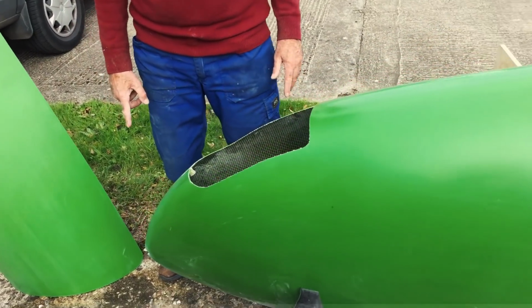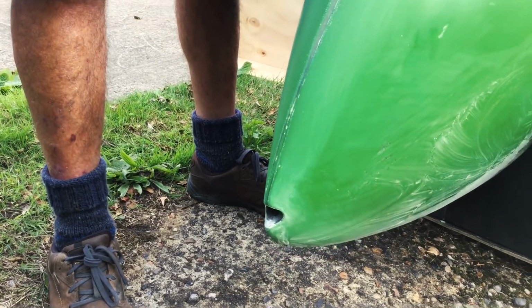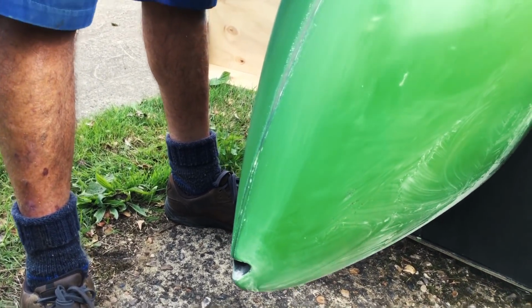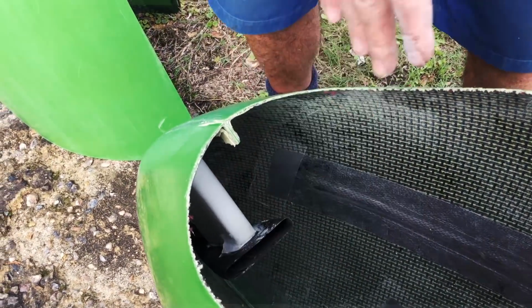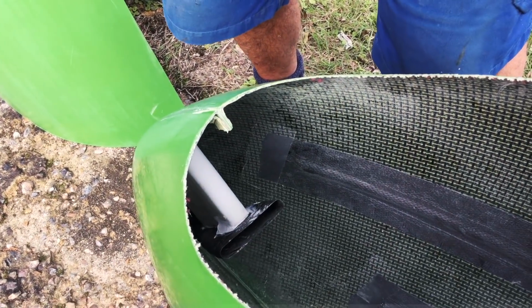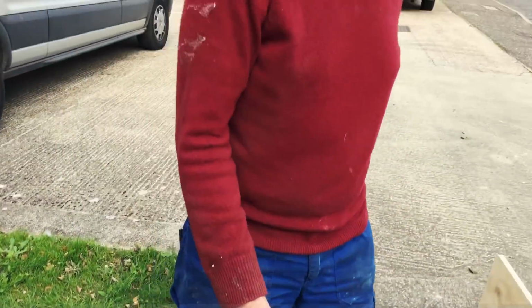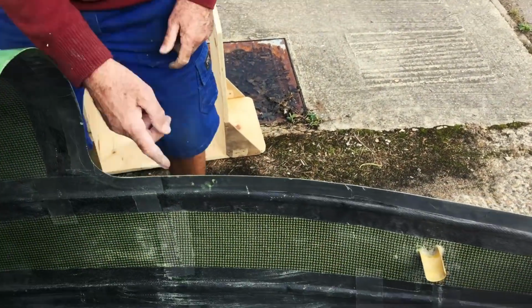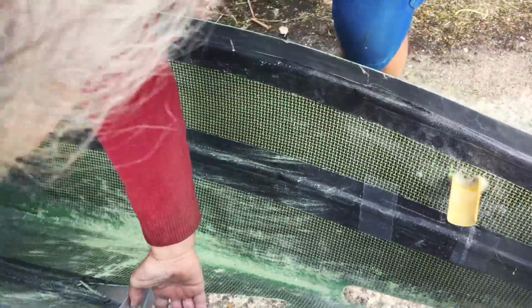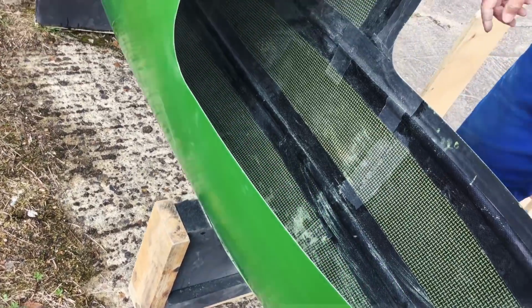First of all, one thing you need when you're inside: see, this will be a screen, which is not molded as yet. Little tiny hole. That's where the air will rush in, hopefully adequately, but without causing too much drag. It will then come up inside through this carefully shaped little scoop that expands, and that will demist the screen and hopefully provide enough cooling air for the engine. So there it is, a beautifully streamlined, laminar flow optimized shell, and that's where the landing gear you saw will hopefully pop in and out, and you'll have perfect aerodynamics when you go.